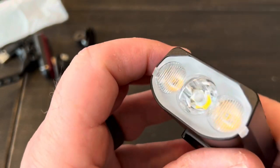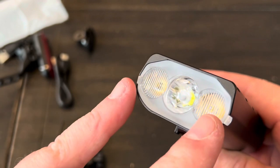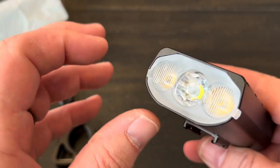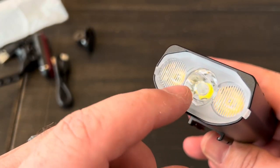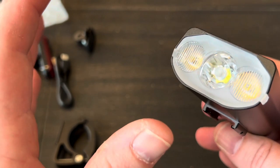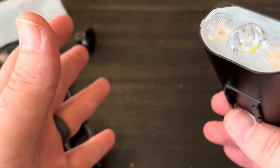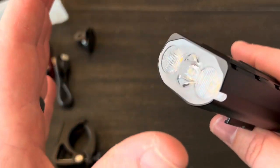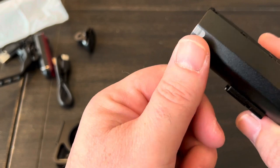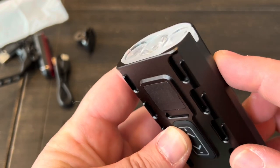Going over the light front to back: the three LEDs have different color temperatures. The two outside floodlights are around 3500 Kelvin — a yellowish, warmer color — while the center spotlight is around 5000 to 5300 Kelvin, more toward neutral white. Combined they produce around 4000 Kelvin, a neutral tone. These little side lights have lenses cut out to allow light to come out sideways, spreading it a bit more to the sides. On the bottom is where the mount slides in, and it can go either direction.